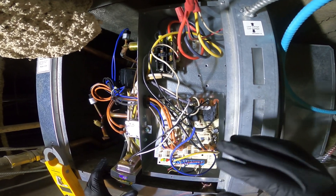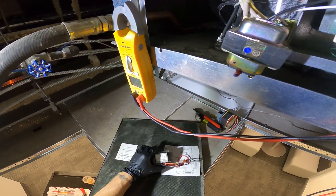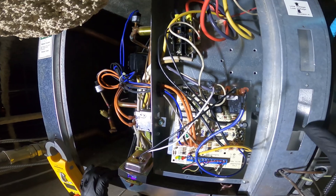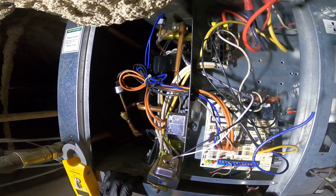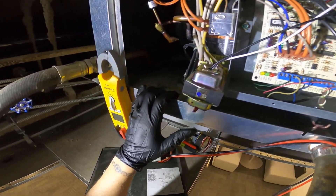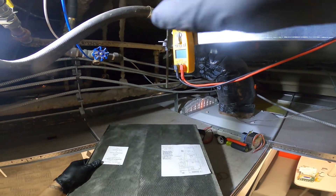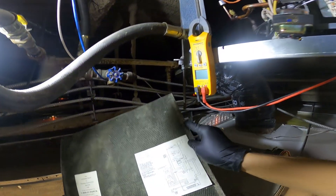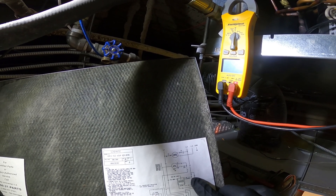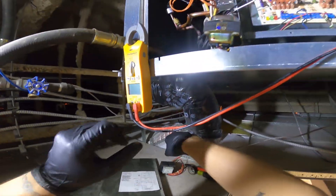The low voltage is here. Looking at the diagram, we have a 208-volt primary — so that's what's going on here. The previous tech put in the wrong transformer, and if I wire this for 120 volts, my new transformer is going to fry as well.